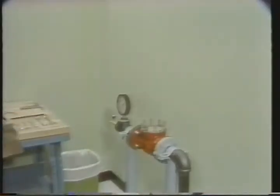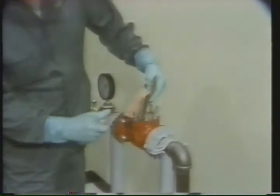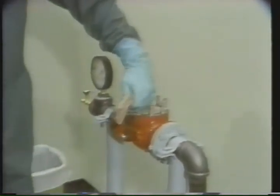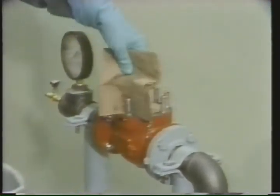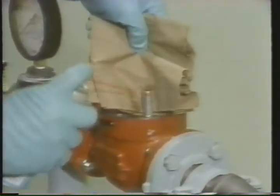After using a metal thread cleaning tool on the body studs, our technician will do a final cleaning with an approved solvent. The solvent will remove material that came loose from the filing, or any remaining dirt, processed fluid, or rust. In addition to easing the bonnet assembly reinstallation, there's another reason why it's important to get these threads clean. Later on, during the reassembly, we'll be applying some anti-seizing compound, and the compound adheres better on a clean surface.